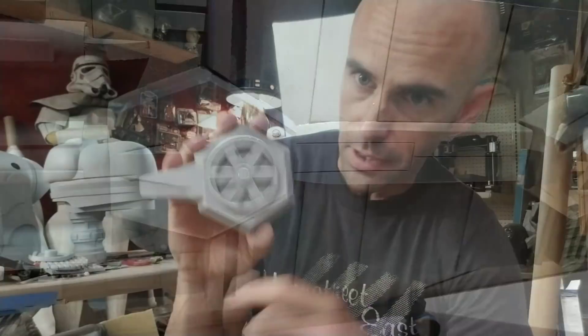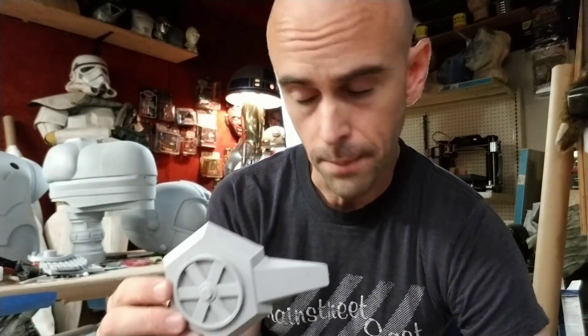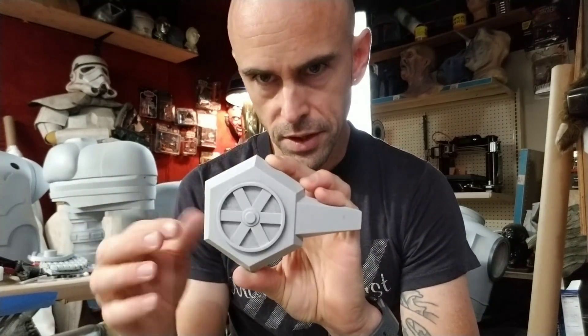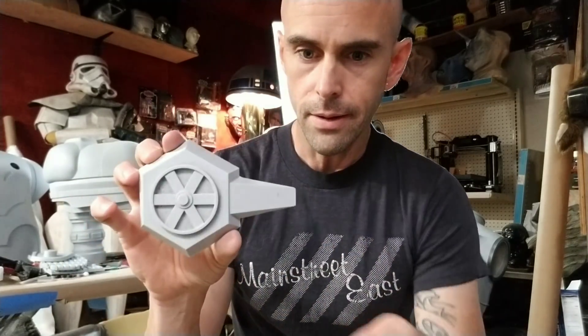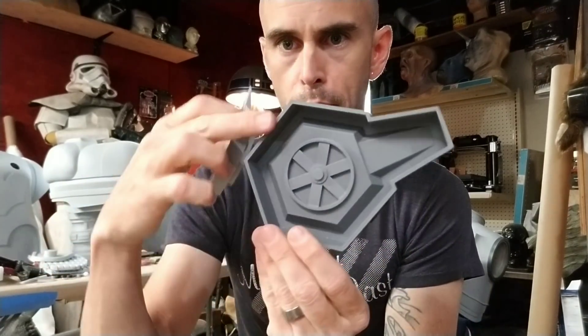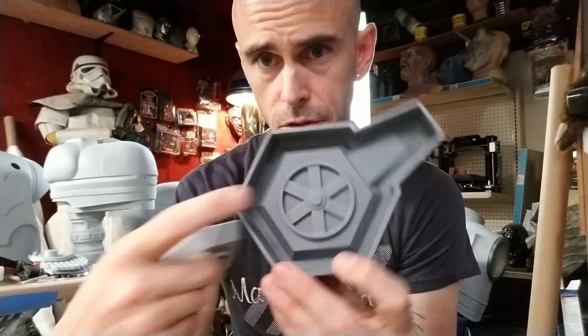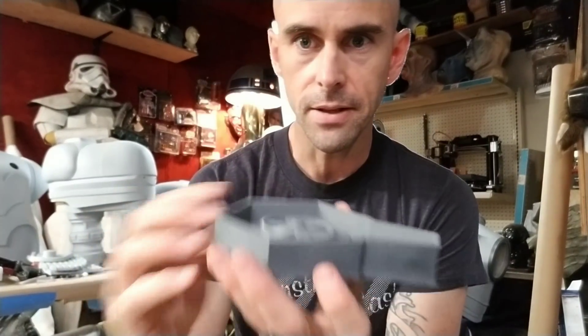In doing the details, a couple of pieces I just wanted to 3D print because I was super busy and didn't have time to fabricate them. So I was trying to cut some corners and cheat for time. I 3D modeled this part and printed it and then I molded it. Typically I would model a part like this, print it, build a little box and mold it, but I don't really have time for all that. So what I did is I actually printed the box around the part — this is one piece — and this wall is strictly made to contain the silicone.